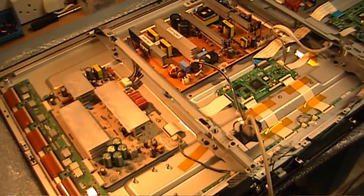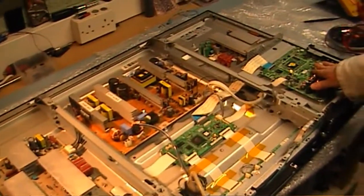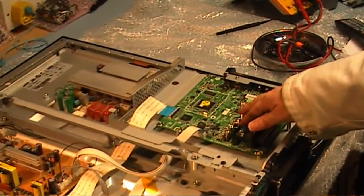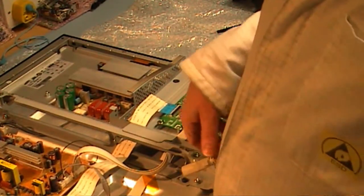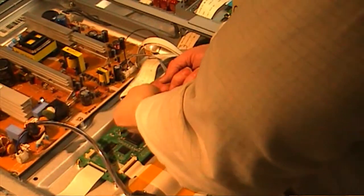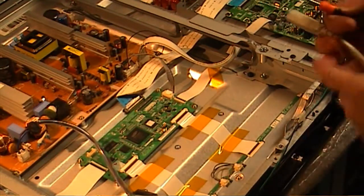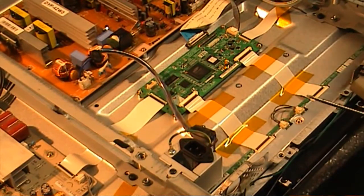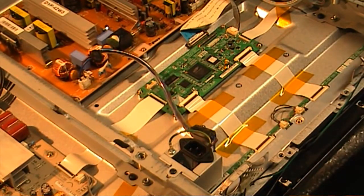I could disconnect totally this main PCB over here. I will unplug it and remove the control connection — it goes along this cable here — and do the exact same thing, verifying that it is not under the control of the main PCB. The control board and the power supply are powering up and controlling the screen without any influence from the signal board.